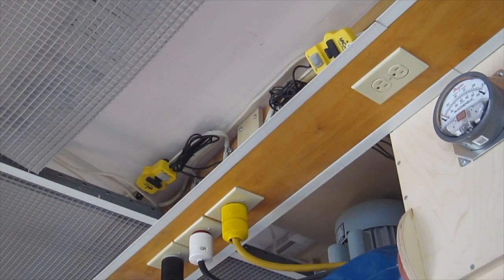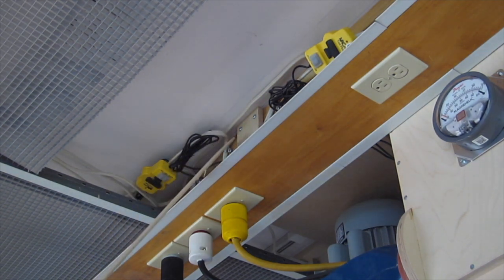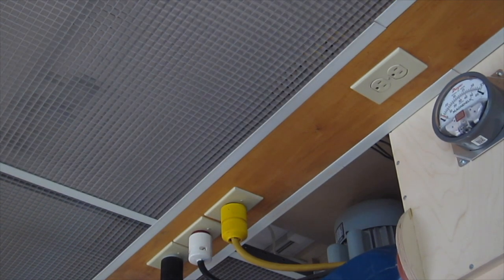There are no ducts across the floor to trip over, no ducts across the ceiling that would get in the way when you're moving lumber around, and no ducts along the walls that would use up wall space. Each tool requires a sensor on the power cord, and those sensors are located out of the way — hidden into the electrical wiring that goes to each outlet. Those sensors send a signal to the IVAC blast gate telling which one to open to direct the airflow to the appropriate machine. So they're all hidden as well.